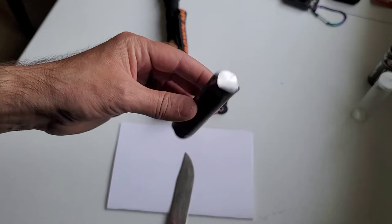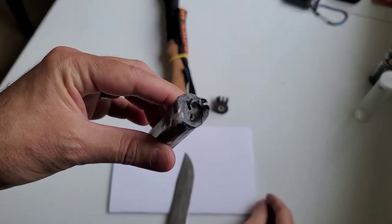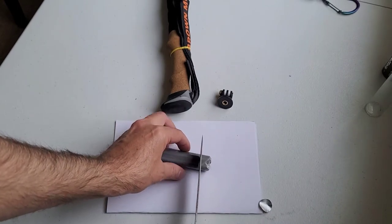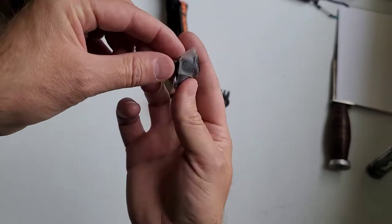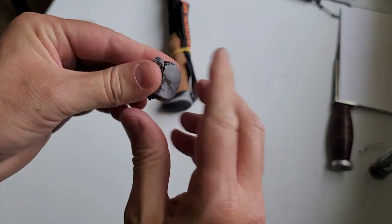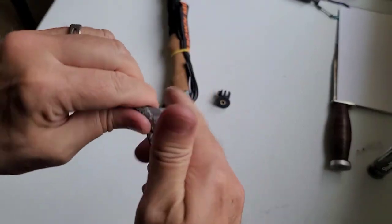If you have a leak, it does amazing things. JB Weld and duct tape fix anything. Okay, so the JB Weld comes wrapped in plastic, and it has a cover within. Just peel this off, and you can see how that's two colors. So what I do is I just peel that plastic off, and then you just start kneading it together just like Play-Doh. And you don't have a lot of time with this quick set.